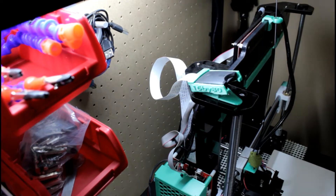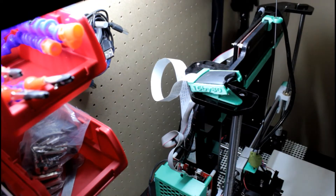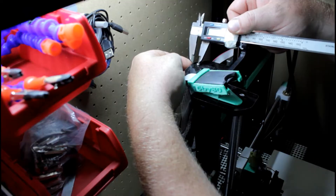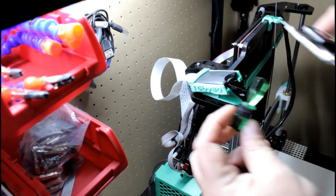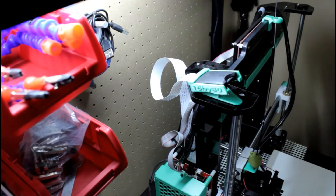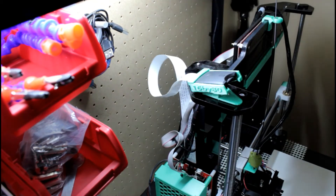I had a bit of a rethink on this. What I think I'm going to do is have the bracket come out here and kind of just hook into this main support. To do that we need to diagram it out: 0.4 this side, 22.38, but then this is 24.5 mil long. So we'll go 30 mil towards the back, 30 mil this way. I think that'll work — it'll make more sense when we go to the computer.